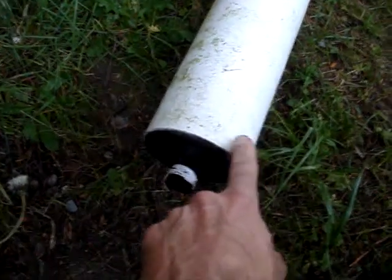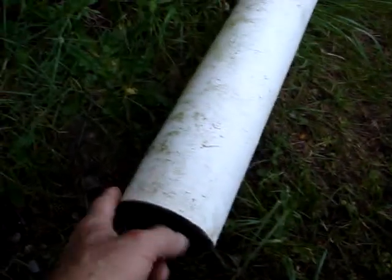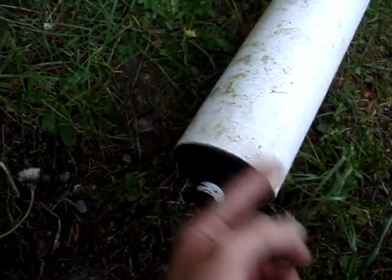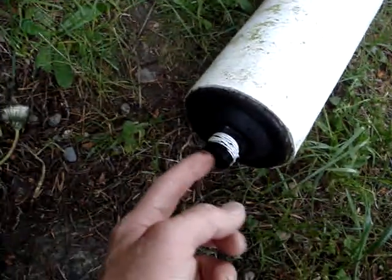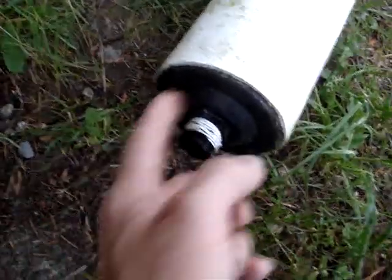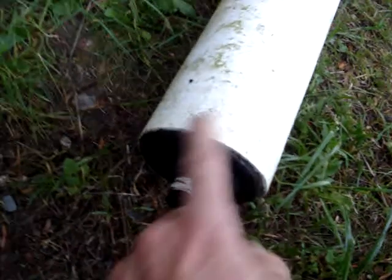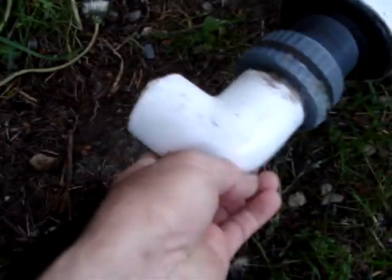Then this will fill — that'll pre-wash. It'll flush the outside; the outer diameter will flush the first rainwater, and then the center pipe will run concentric inside of this larger pipe and it'll have perforations on it. Then the spillway will go into this other pipe like this, but this will be a T.